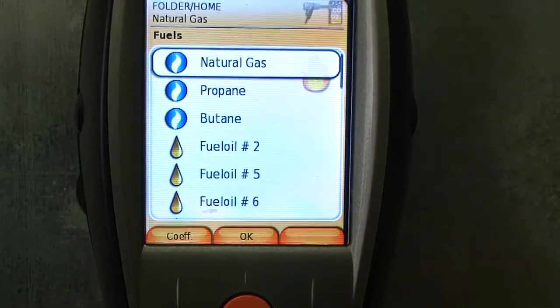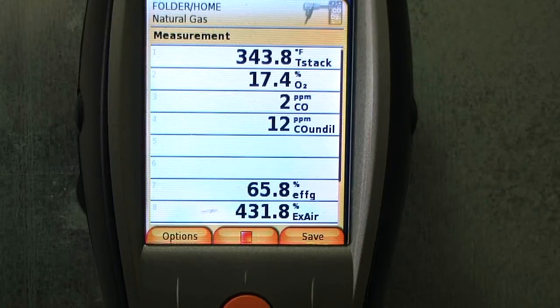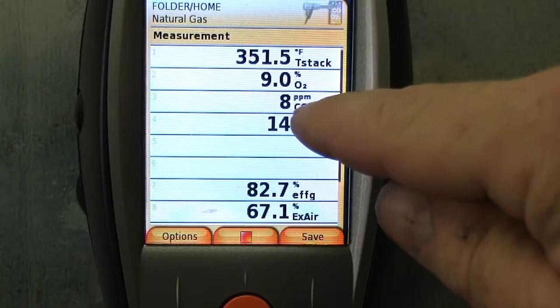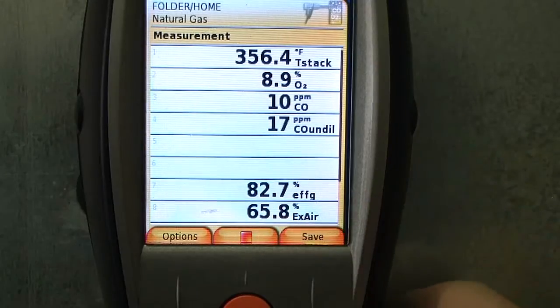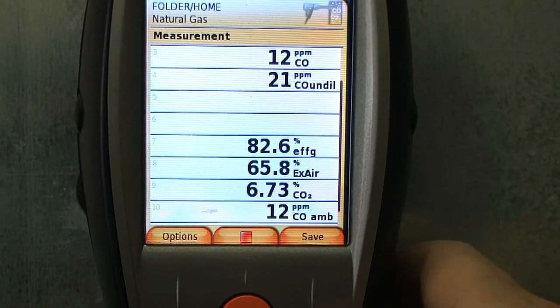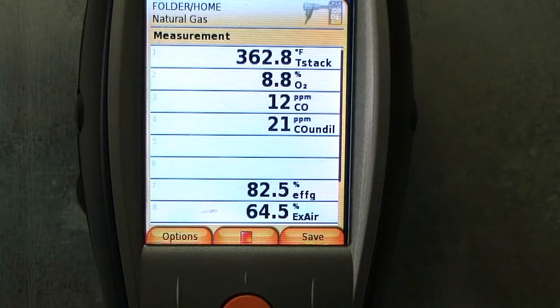We're on natural gas. We're going to hit start. Once it zeroes it won't have to zero again. We're going to let it run for a few minutes and let it balance out. We're going to look at our carbon monoxide — that needs to be under 10, and almost every one I read is. The efficiency of the furnace is what it's running at right now: it's 82%. This is going to be excess air, and carbon dioxide. I don't know how this thing picks up CO ambient — it always reads 11 and I don't have a probe hooked up. Everything looks pretty good, I don't really see anything off.